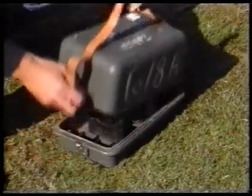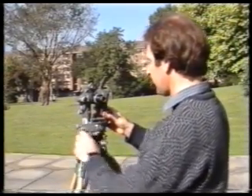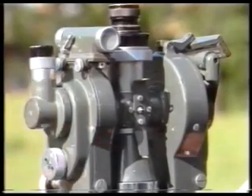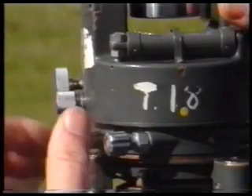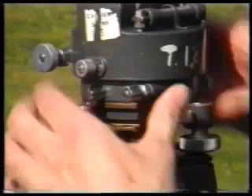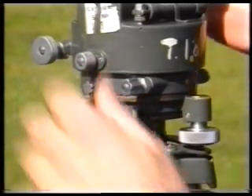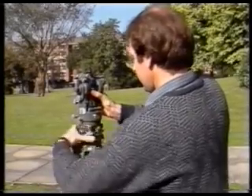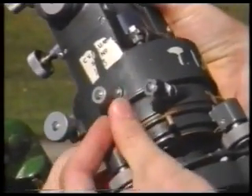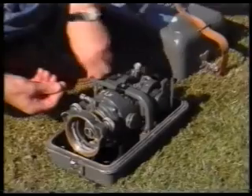Don't start packing up until you're happy with the results. It's essential to take additional readings if you're not sure. While the theodolite is still on the tripod, close the mirror and put the telescopes in a vertical position. Align the theodolite as it was when you took it out of the box — this one has spots of paint as index marks to help you. Slide the theodolite horizontally back into the centre and bring the foot screws to the middle of their runs. Now unclamp the upper plate, keep hold of the theodolite with one hand and unscrew it with the other. Do up the clamps again and put the theodolite back into its box. The reason you opened the box earlier is so that you don't have to put the theodolite on the ground in order to open the box now.